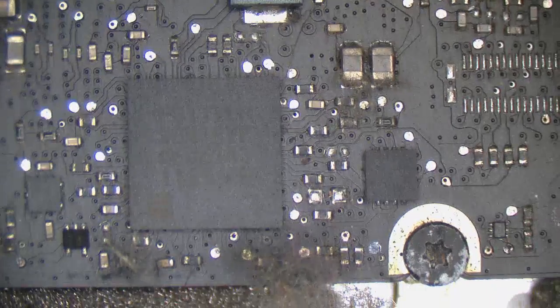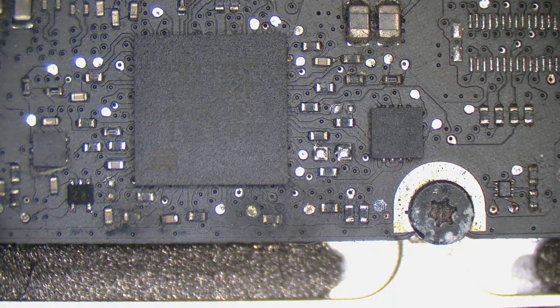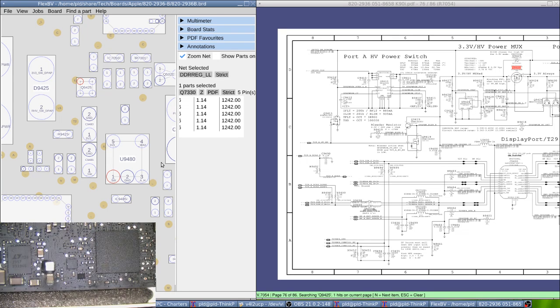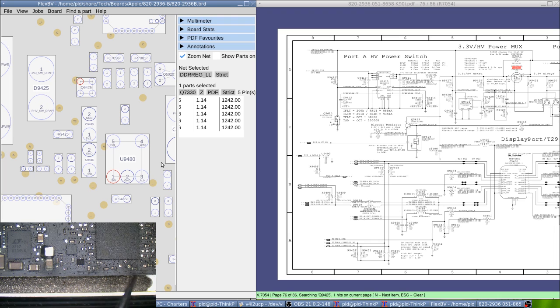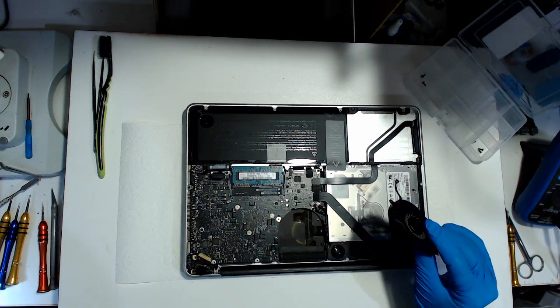Let's have a look around the board — give it a brush down. We can already see fairly traditional bottom edge issues. There's some corrosion down here. Those three parts there could be problematic. We've got a nice chunk of corrosion there. At this point our best course of action will be to clear out these bottom parts. I'm going to take the board out because most likely when these components are upset, on the other side there's often something corroded as well. A little bit of dust build-up — dust bunnies — would have kept it a little warm.